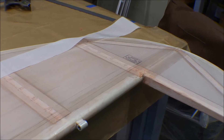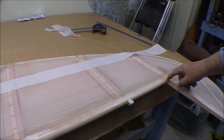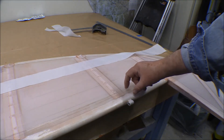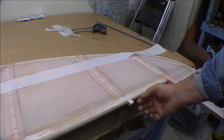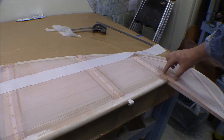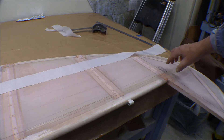Now I'm laying out the finishing tape for this forward spar and that's going to have to be 2 pieces of tape. I could use one piece of 4 inch tape, but I'd have to have some kind of a funky joint right here and put a piece of 2 inch tape out on this end where the spar extends. So what I'm going to do is take a piece of 3 inch tape — I've got it measured out about an inch and three quarters, not quite 2 inches. I'll put the 3 inch tape here so it overlaps down about an inch past this leading edge, then cut right where this rib and spar intersect, fold part of it down, bring that piece out as a continuous piece to the end of the trailing edge, and that will be covered over with a piece of 4 inch bias tape.